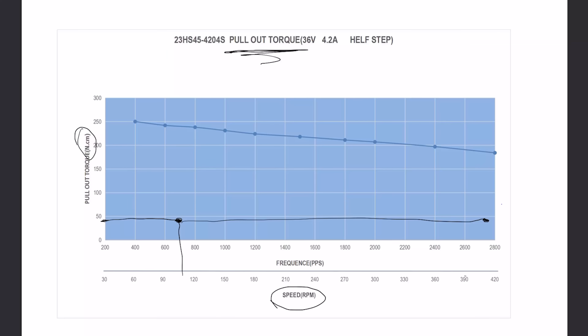But let's say we needed more torque — around 200 newton-centimeters at a speed of about 330 RPM. In this situation, since you've already added a safety factor, it should technically still work. If it were me, I'd still try to inch away from that limit, but I'd also weigh things like whether this is a motor I already have, whether I'm buying a new one anyway, and how much difference in cost a slightly bigger motor makes. I have to leave those details up to you.